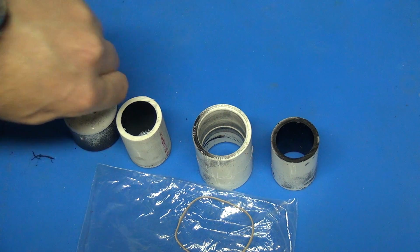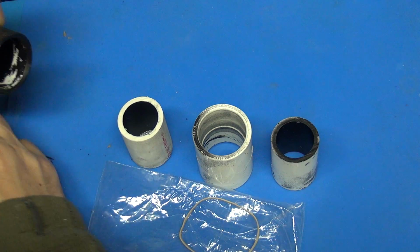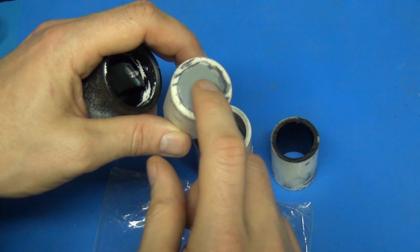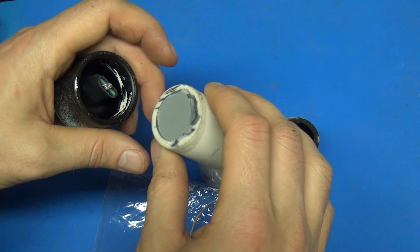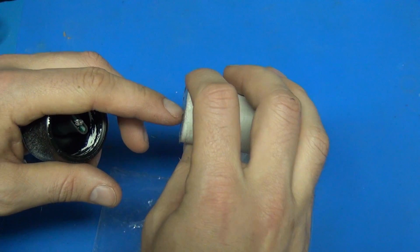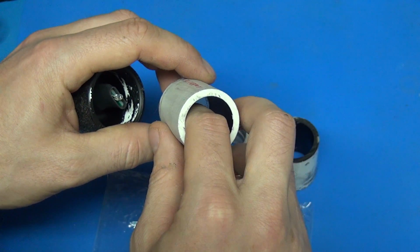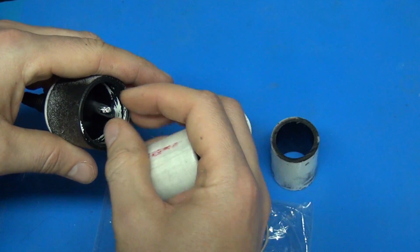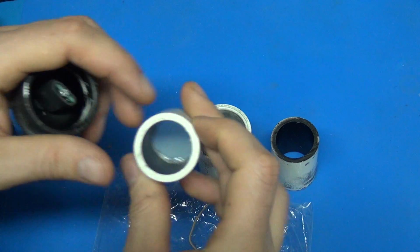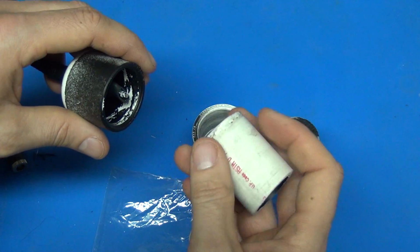Okay, so for the light sensor we do the same trick with the end cap here. And once that's in snugly, we can attach the light sensor. And I didn't mention this earlier, but basically I put a piece of translucent clear plastic on one of the ends of the tube. And that's basically to diffuse the light, so that the laser will shine through this tube and hit that translucent plastic, and it diffuses the laser light over a larger area, so you don't have to hit the exact tip of the sensor with the laser. You basically can hit anywhere inside this tube, and then it gets diffused, and then the light sensor can pick up the laser light that way.